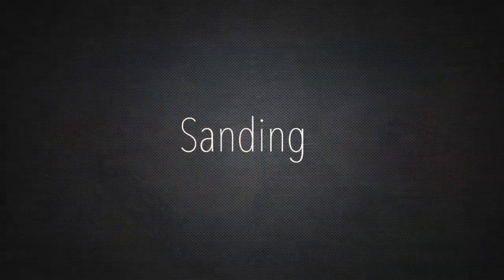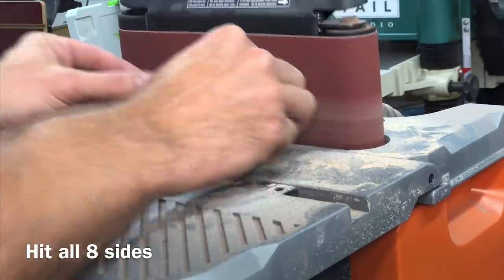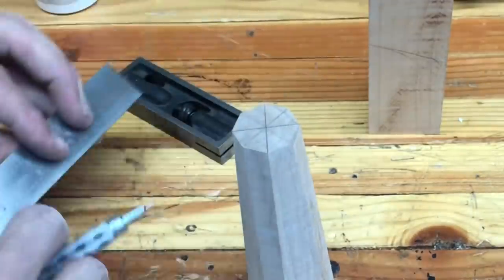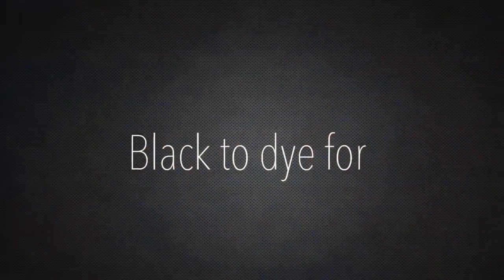Because these were all super straight edges, the sanding was actually pretty easy. I put a 180-grit belt on my oscillating belt sander and just went around, hit all eight sides, rotated over until I got everything sanded just perfect. Then I came over, found my center, and did the same 3/8-inch hole as before.